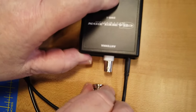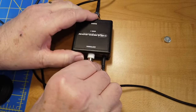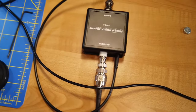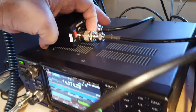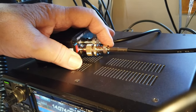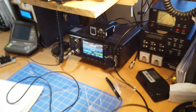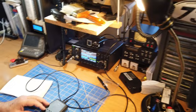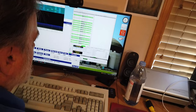The antenna that Chameleon makes has an SO-239 on it to connect, so that leaves me with PL-259. On the back here I put a connector, so I could run a little cable with BNC on each end to the thing, because my station is PL-259 and SO-239. It works, and we see a whole bunch of signals right here.